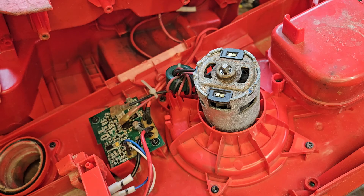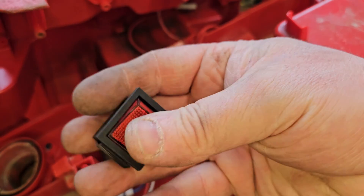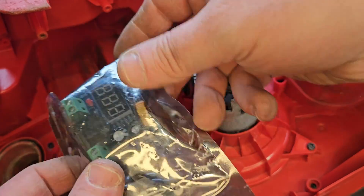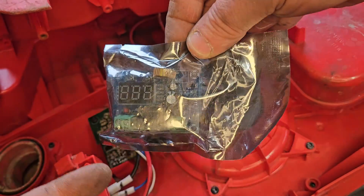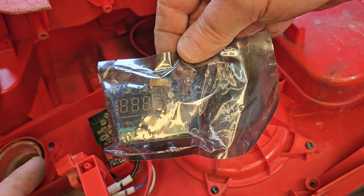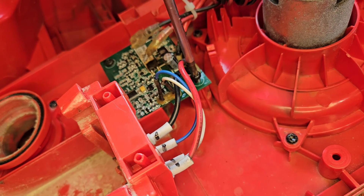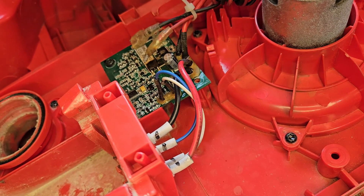So I've had another idea. I can replace the switch with this one — this one's near enough. And instead of the circuit board, I'm going to put on this low voltage cutoff module. I can set this to cut off at 17 volts — when the battery gets down to 17 volts, it'll stop the power and preserve the life of your battery. I'll just remove the board and cut the wires off.